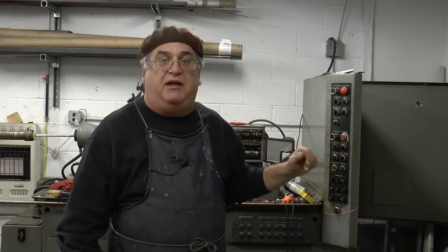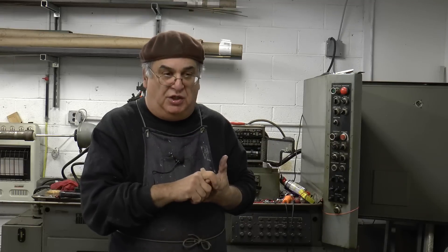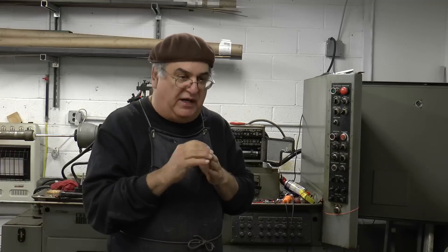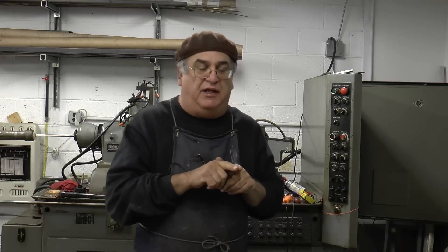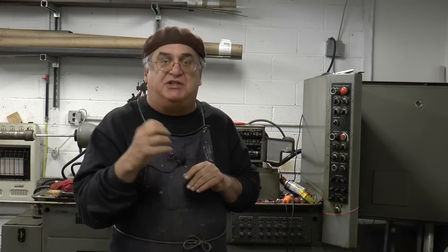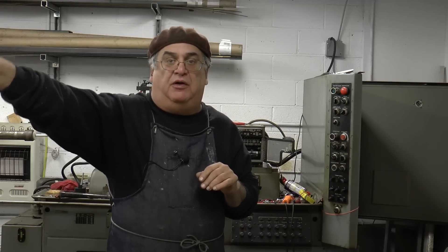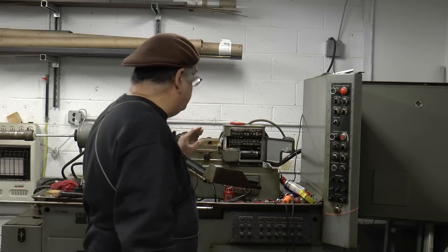This machine is fabulous. When I get it running in another week or so, I'll have it actually up and running completely doing parts. Right now I've got aluminum in there and I'm just practicing. The one disadvantage over CNC is that you have to have form tools — if you want a certain radius undercut, it has to be that size, whereas on CNC you can use a smaller tool and generate that radius. Also, you cannot thread-chase with it; you can die-chase the thread with acorn dies or a geometric head. The other machine over there — I've done a video on that — where you can actually do the threading.